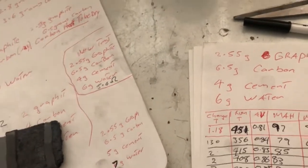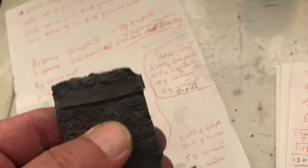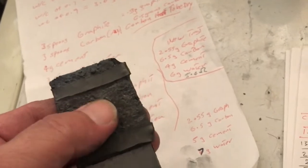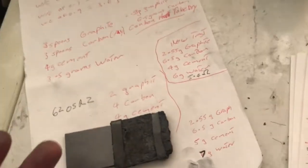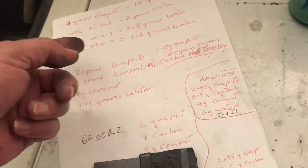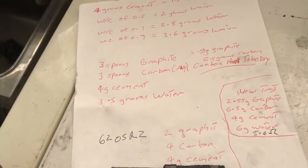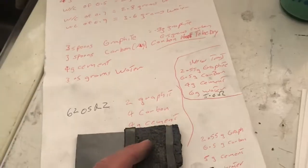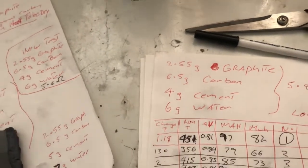When you add this much water it's more like a putty and not easily mixable, so you have to just stir it up a lot. You can actually compress it into that little mold. It's not sludgy - if you make it sludgy it falls apart. The main factor is also how much the carbon absorbs the water, which will take it away from the hydration of the cement content. Your carbon may have a different absorption rate to mine, so you'll have to work on that - these are just base figures. But cement is working all right.